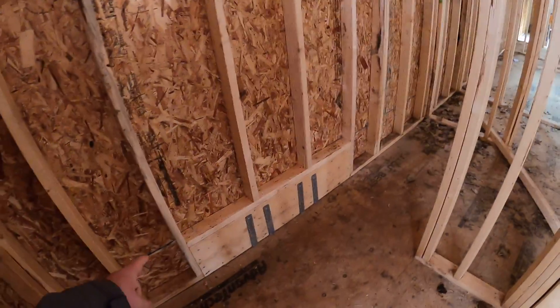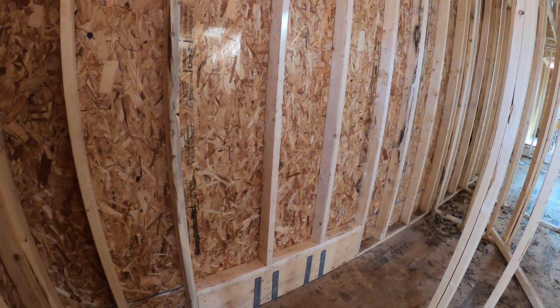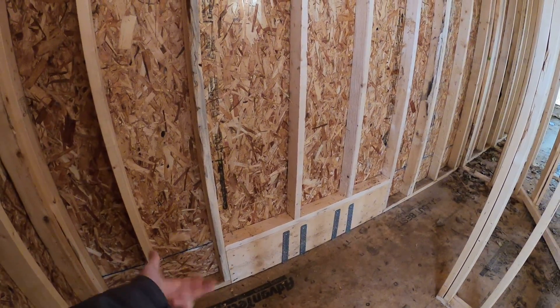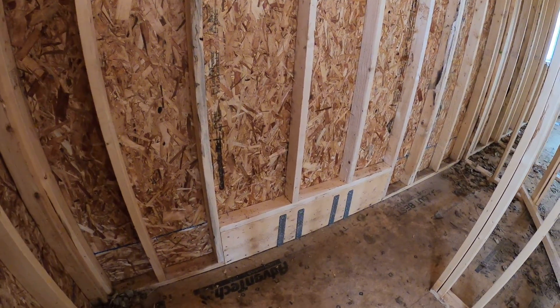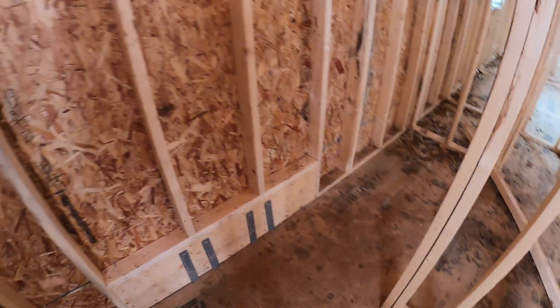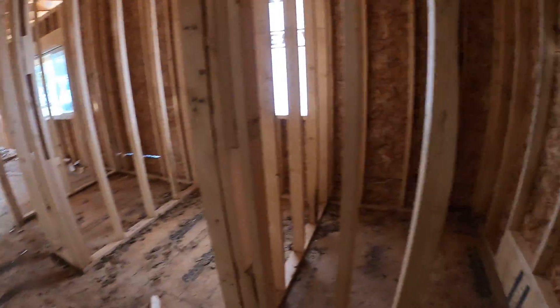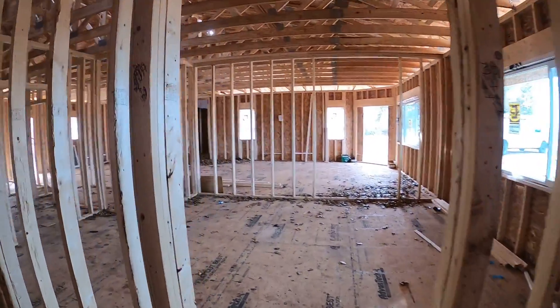On the outside we've got that egress window from the basement. In order to have the right room for a legal egress window, we actually had to bring the header up into the first floor here. What we did is use engineered straps holding up the two floor trusses running through here, so there's plenty of support for everything — and we were able to still make that window work down there. There are always different options for everything we come across.